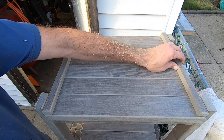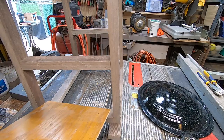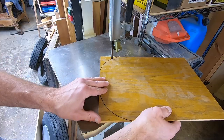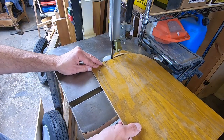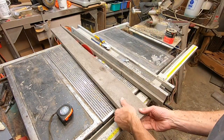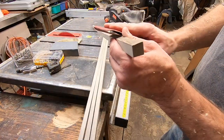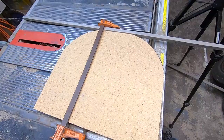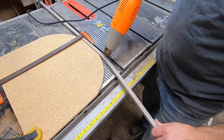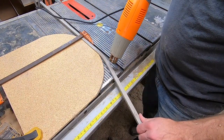To get this to look like the original I need to figure out a way to bend the wood. To achieve this I cut two wood templates — one for the front and another for the sides. I clamp the Trex strip at the top of the template, then apply heat with a heat gun — enough to warm up the plastic wood without burning it. After about 30 to 60 seconds it becomes softer and you can bend it around the wood template.